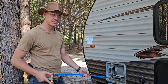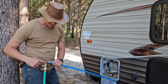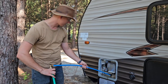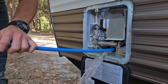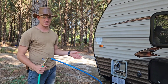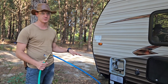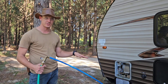The tank was so calcified and there was so much gunk in there that I'm actually going to try to flush it out a little bit more before I replace the rod. I have this little contraption that lets me hook a PEX pipe up to my hose, and I'm going to use this to flush out as much of that crap as I can. You can buy a pre-made hot water tank cleaner, but if you're interested in how to build one of these with a handle and everything, I'll put links to those parts in the description. I'll also put a link to my other video where I used this same setup to unclog my RV toilet and flush out my black water tank.